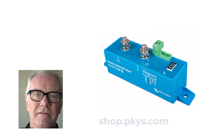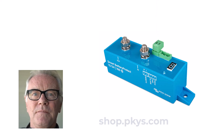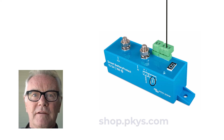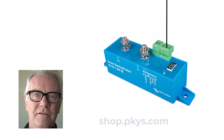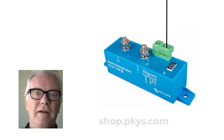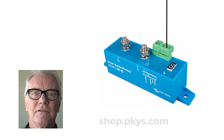There are a few wiring things to note for all installations. There is a negative connection required for the Battery Protect to operate, because it has its own electronics and that completes the circuit for the electronics. If you read the instructions carefully, you'll see they want a small fuse on that negative wire just to protect it in the event of an internal fault.